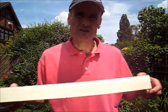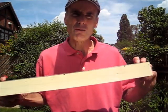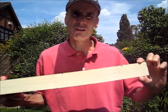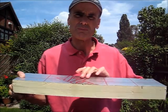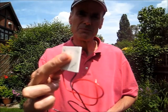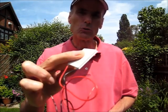So what we're going to do is try making a cool box using this expanded foam insulation. This is 50mm thick, or 2 inches thick, so we'll be using two layers of that to get the walls of the cool box. And we're going to be using this amazing device here, a thermocooling device called a Peltier.